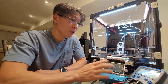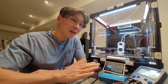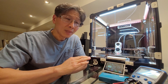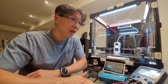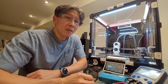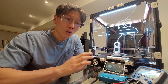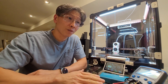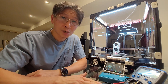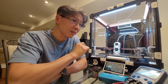When people say their extrusion is flat and put it on a glass table, the glass table is not flat — I can guarantee that. Any glass table or kitchen countertop is not flat, period. Some people put their extrusion on a countertop and see light shining through, but maybe the countertop isn't flat and the extrusion actually is. Unless you have a calibrated surface plate, you can't really tell. Nothing around your home has the kind of flatness needed to check an extrusion or linear rail.